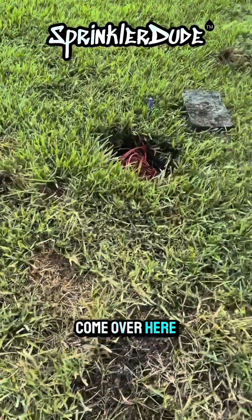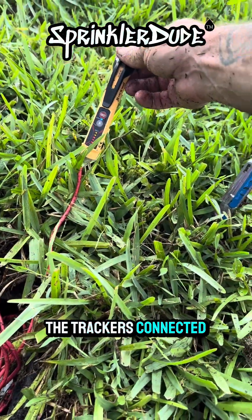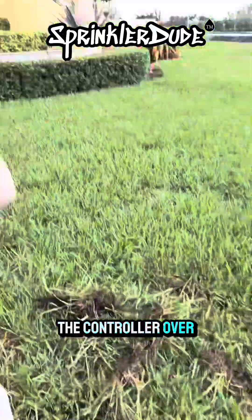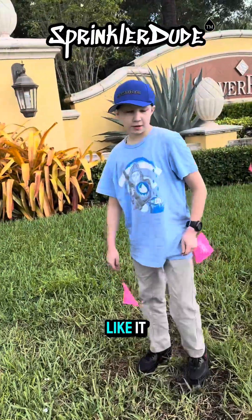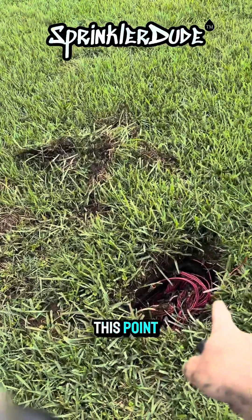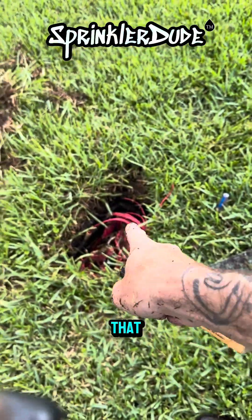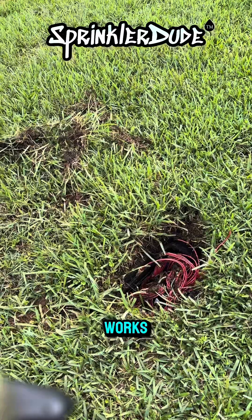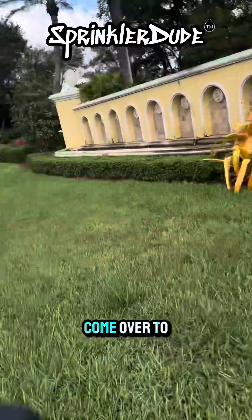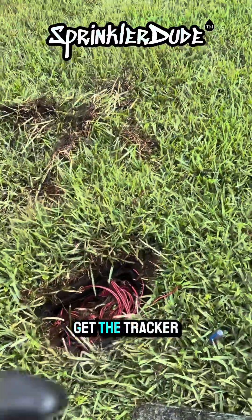Thank you for flagging that. When we come over here, I already did all the detective work to find out that that's the wire we need. The tracker is connected over by the valve to this wire, and it wasn't connected to anything in this junction box, so that means it's not making it back to the controller over there. The next thing we need to do: since we know the wire going from the valve over there to this point, we need to figure out a good wire from the controller to this point, and then once we figure that out, we connect those two wires together and we have a valve that works. So we need to go grab the tracker from where we have it over there, reconnect that valve the way we found it, come over to the controller with the tracker, and hook it up at the controller to tell us which one of these wires we can use.